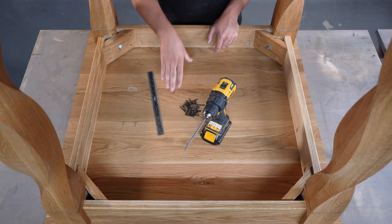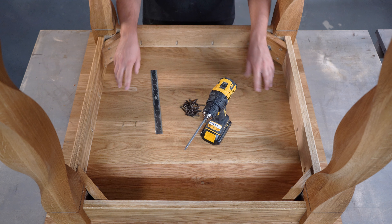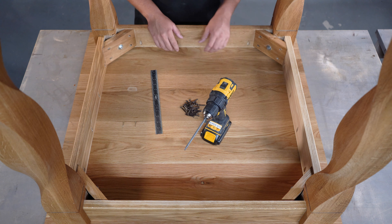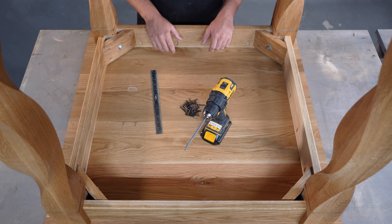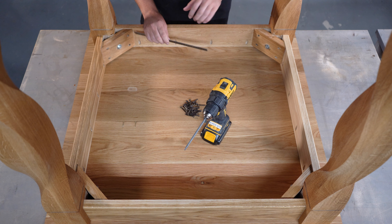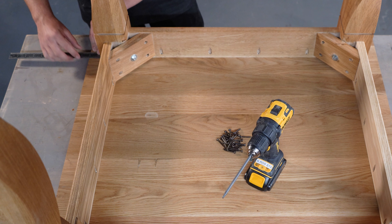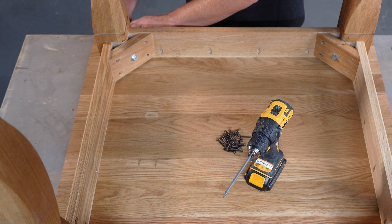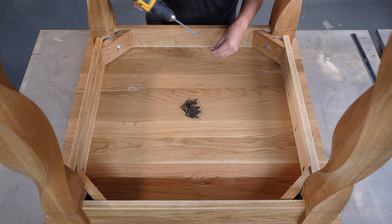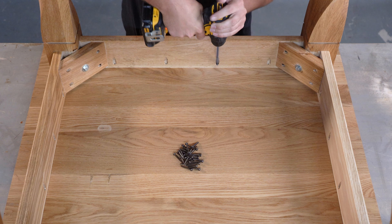Now that we've finished both our top and our base, we're ready to attach them together. You can see that this table base kit has pocket holes for attachment into our top, but we also have other options on our website like the z-clips or the figure eight fasteners if you're looking for an attachment solution that allows for a little bit more wood movement. For this project we're going to use the installed pocket holes. Now we had this base made to have a two inch overhang on all sides, so I'm just going to come on each corner where my legs are and measure out and just make sure that that's hitting two inches to the edge of my tabletop. Once I'm sure that my base is centered onto my top with the proper overhang, all we have to do now is take our screws and install them into the pocket holes.